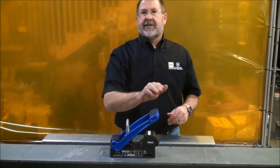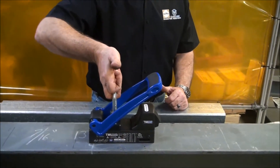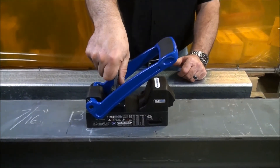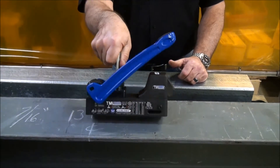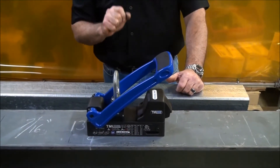So I'll show you with the magnet turned off at the moment a little bit about what these directions mean. In a pure vertical lift, it's actually got quite a bit of force. If I try and pry it sideways, it's incredibly easy to pry off. So if I was using a chain and it was at an angle like this, I could depend on having a lot less holding force available.